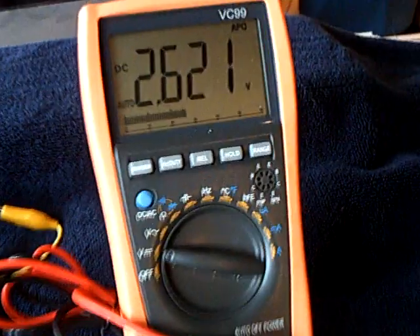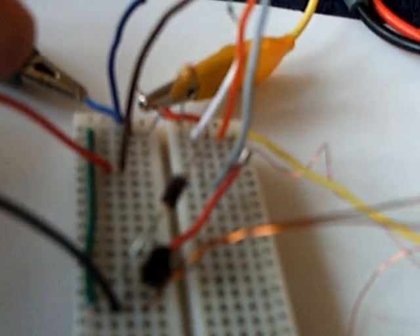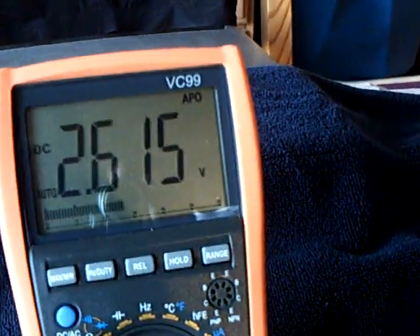Okay, here we go. What I'm going to do is show the capacitor voltage on that little capacitor right there. When I take the battery off, this is going to drop like a rock. And then I'm going to flip this switch on here, and that's going to engage this little 1N4007 back into the front of this with the flyback coming off the drive coil on that bifilar coil. So here we go. Watch this. This won't mean much to people except the ones that are working on this project.